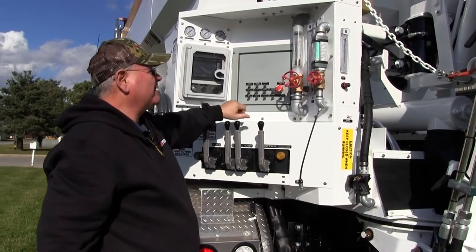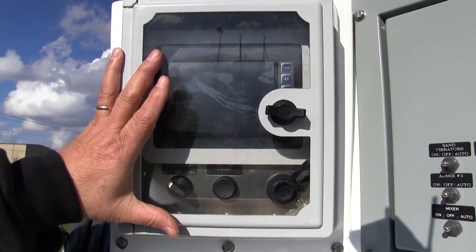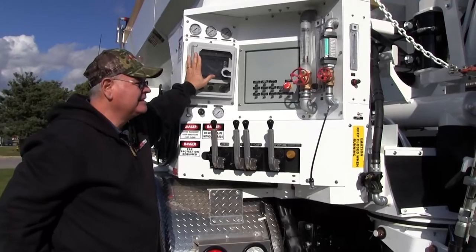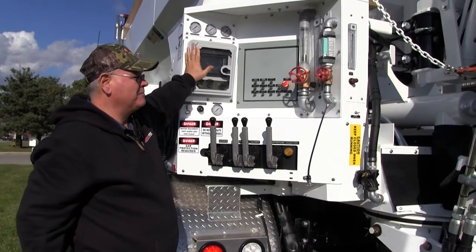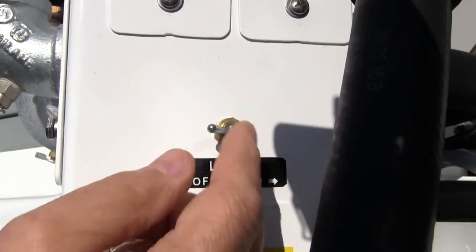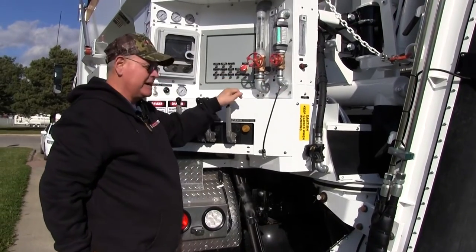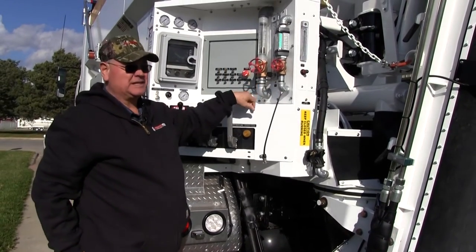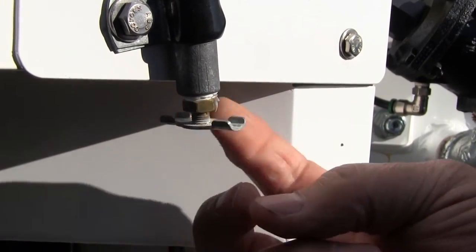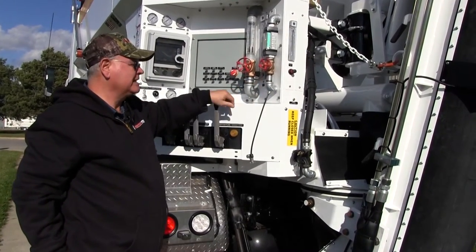Discharge through your calibration process. The AccuPrinter here is what is going to receive the pulse from the recording meter and will record the amount of latex that you're putting into the concrete, and print it on a ticket if you'd like. It also has a little air switch — latex off and auto — which turns on the air signal in the auto position so when the conveyor starts, it opens the air piloted valve. If you don't want to run latex, turn it off. That's how you can calibrate the two independently from each other.